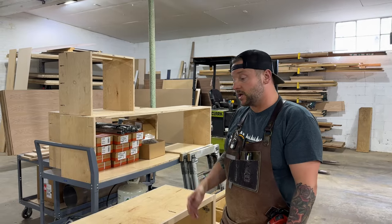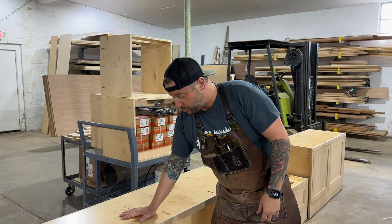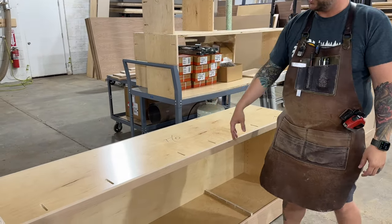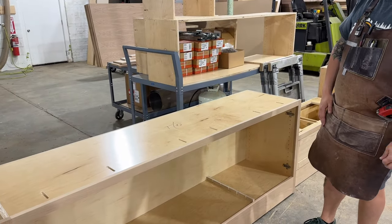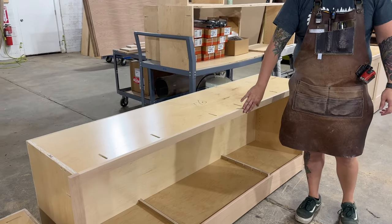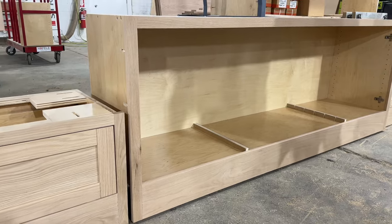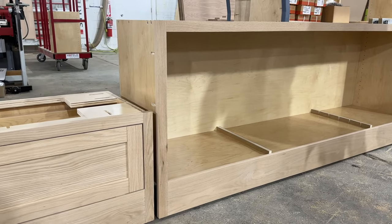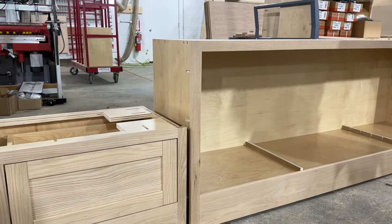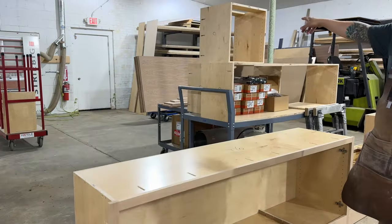So I'll tell you a little bit about the materials. We have pre-finished plywood cabinets — these are maple with pre-finished UV two sides. We have red oak face frames and red oak doors, and these open cabinets on the top will be made out of three-quarter inch MDF core with a red oak veneer, and we have that back here.